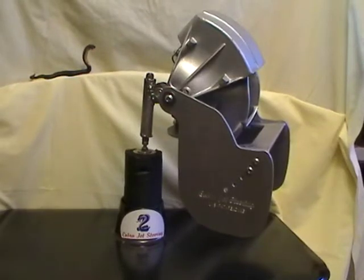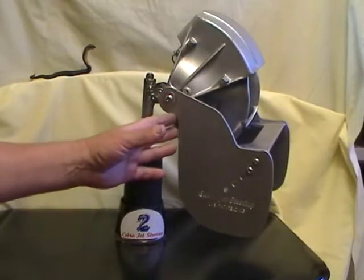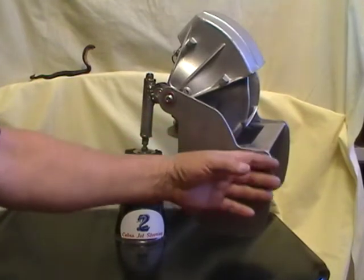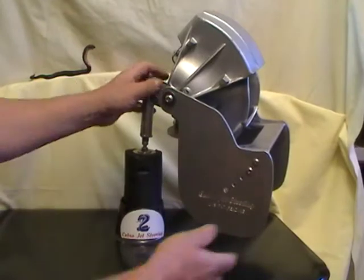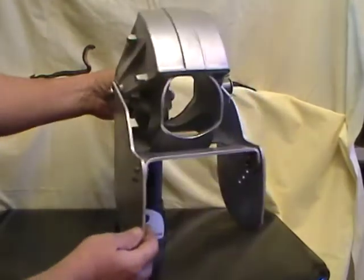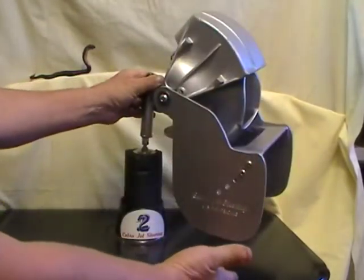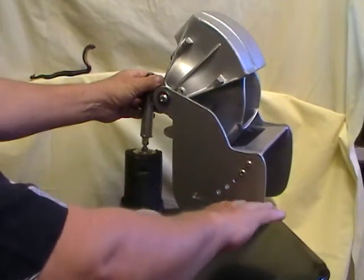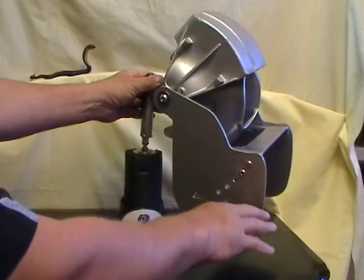In this particular design, I want to point out a couple of things. Number one, we're behind the nozzle back here on the back edge, so the turn radius is more effective. Therefore you don't need to go further down below the boat, because you're back behind the boat. The water coming off the boat catches these fins and makes them a lot more effective.